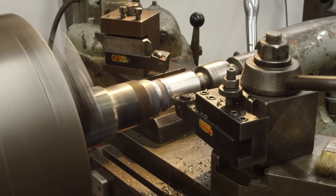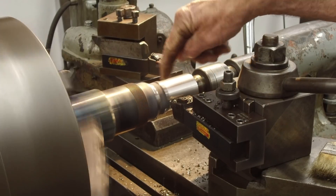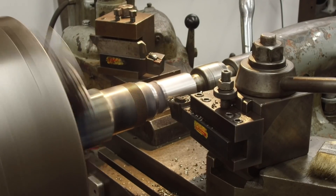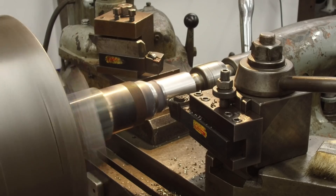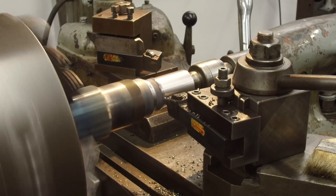We're down to the root or slightly below the root here — that will come off the end. We'll see what we've got. We might have to come in and dress a little bit of that valley and then I think we're pretty well prepped to add the weld buildup we want to put on this part.